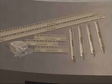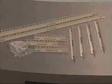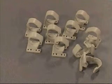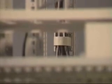The recessed rail kit provides mounting options that recess equipment to allow adequate room for cables that protrude from connection ports in the rack. The cable management kit includes clips that hold up to 40 Category 5 cables. The clips can be attached to the inside of the rack, the face of the mounting rails, or the front of the equipment, either horizontally or vertically, depending on your needs.